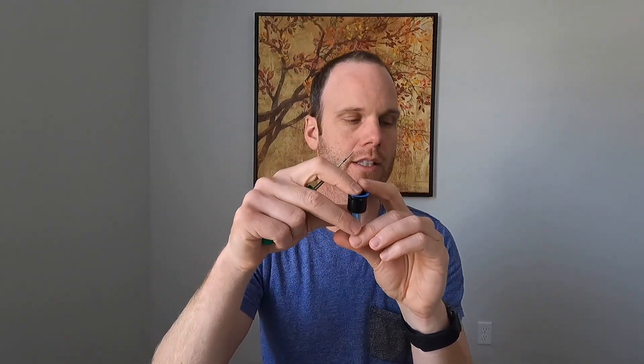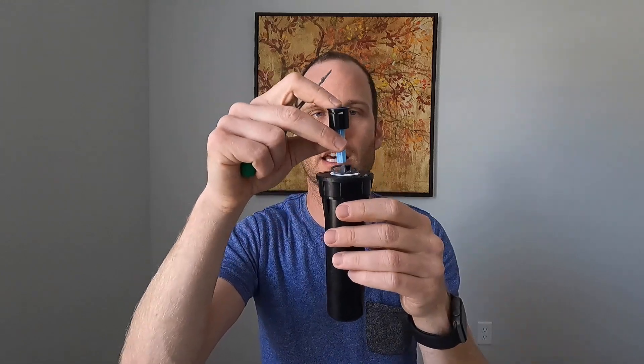From there, you might have some nozzles that are not spraying correctly, and sometimes it has to do with the filters being clogged. I would say 80% of the time it's the filters clogged. Check the filters — they just go into the sprinkler heads like this, and down in here. If you unscrew the nozzle and open it up, you'll see that a lot of times it's clogged, and you just throw out the old filter and put a new one in and it's spraying right again.